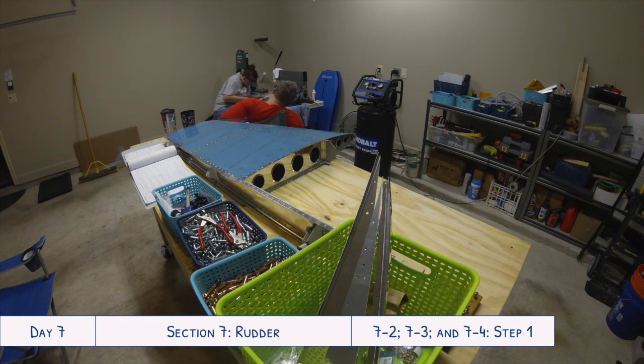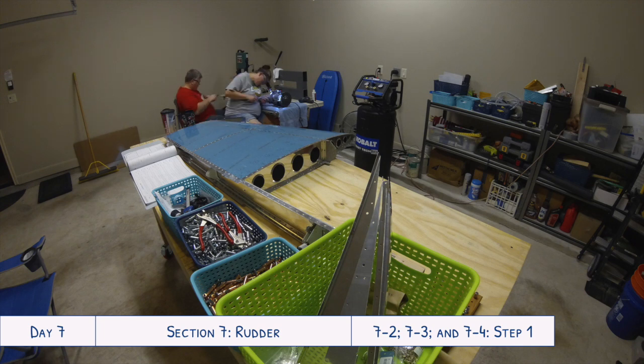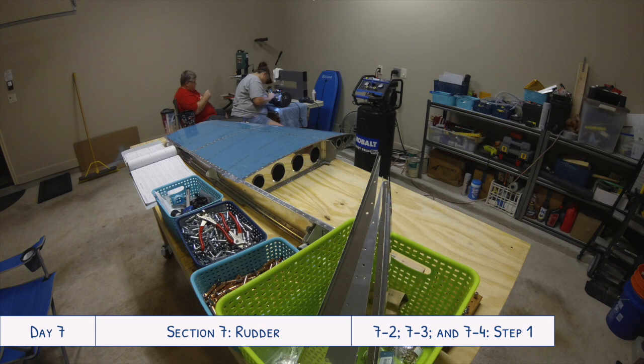What we then started working on here — Tyler had taken all of these stiffeners and you have to cut them to different lengths, because as you go from the top to the bottom of the rudder it's narrower at the top and wider at the bottom, so the stiffeners are shorter at the top than at the bottom. Each one of these stiffener pieces was a long single piece that had already been folded at a 90-degree angle, and then you had to measure them and cut them down to these ever-decreasing sizes. Tyler already measured them and had me go back and double-check, because it's always better to measure twice and cut once instead of having to order a new piece and wait.